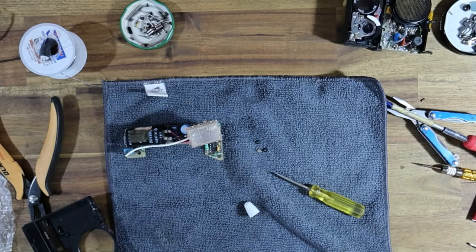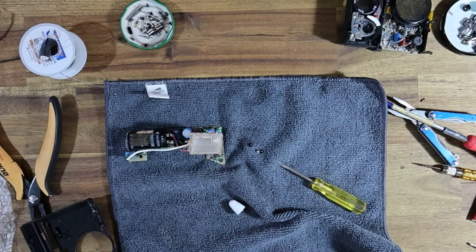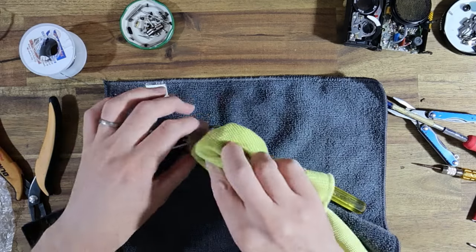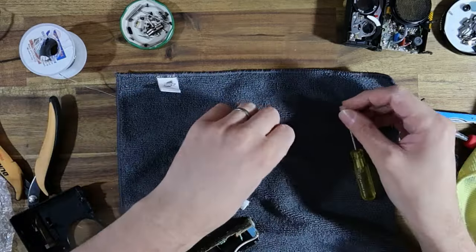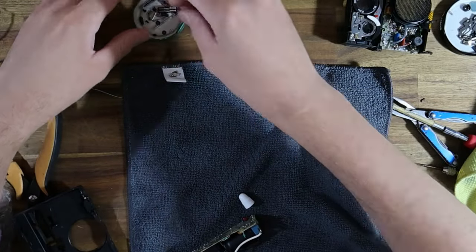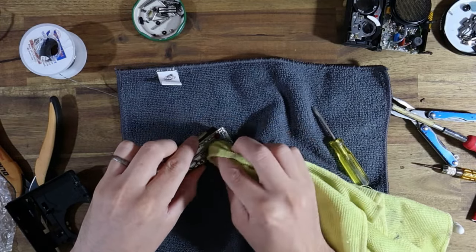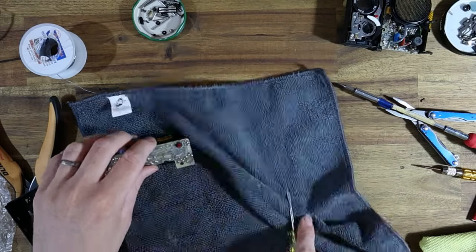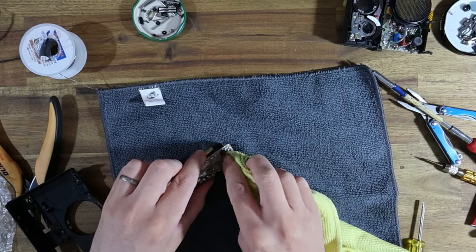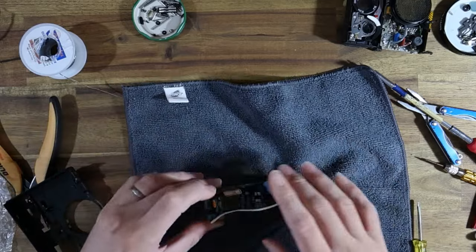This flash also has some dark marks on the front — I think it's just crumbling leatherette, but I'll see if I can give it a bit of a clean. That's coming straight off. I'll get a bit of lens cleaner — it's much easier to do this while everything's off the camera. While I'm on this side of the flash, I'm just going to clean the switch terminals with some alcohol. If you have problems with the SLR 680 not firing the flash, you can come and re-tin these little pads with solder — sometimes these switches just get oxidized over time. These ones look really good and I know the flash worked fine, but that switch is important to clean if you're having trouble.